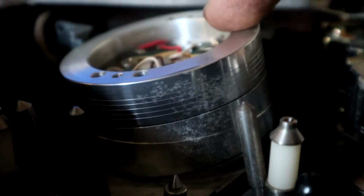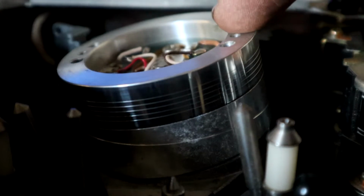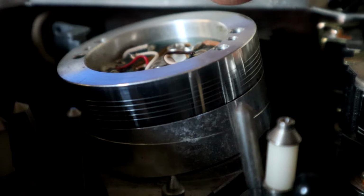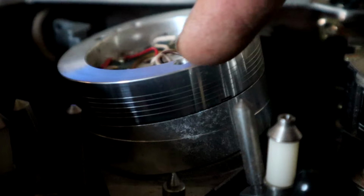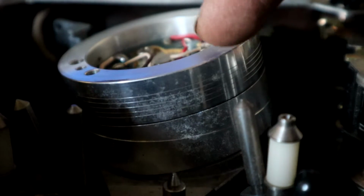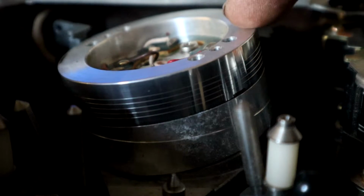That really needs to get polished up. These little strips, see these little scratches in here, they're meant to be there. That helps it. It's like a sort of air cushion. It means the tape sort of glides over the top of the drum rather than really forcibly pushing against it. And obviously having all this corrosion here, it's probably absolutely mullering any tape that you put through it.